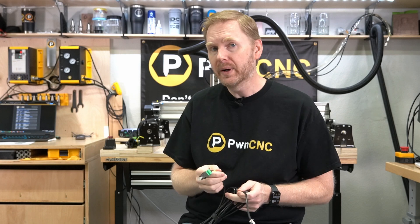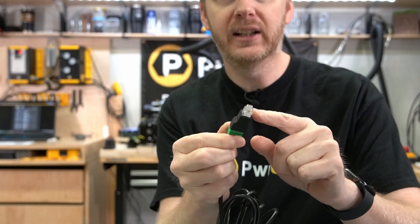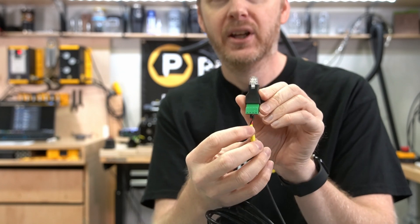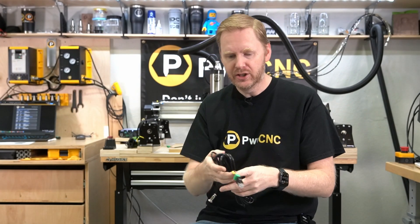I'm not quite happy with that because it's not plug-and-play, so I'm going to be working with my cable manufacturer to come up with a proper solution. I've already tested it. They do sell these special connectors that turn your RJ11 connection into a Phoenix-style screw-in connection. I've already validated that it's the middle two wires — the red wire is on one side and the black wire is on the other. It's just a two-wire connection, a two-way communication — it's not just a fire-and-forget like the PWM. It's a 'hey, run at this speed' and it checks whether you're actually running at that speed. It's a much better connection and allows for more accurate RPMs.